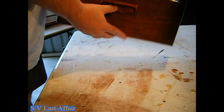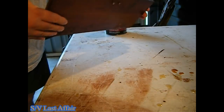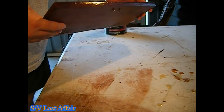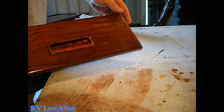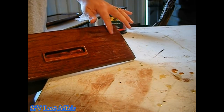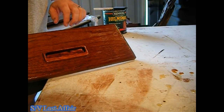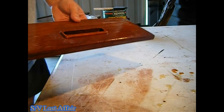Here is one of the faces of an access panel in the rear stateroom — mainly covering storage under the curve of the hull and air conditioning ducts. You can see a blemish here — a high spot that was on the varnish. When I sanded this down, you get that discoloration. As long as you do a light sand between coats, that will not show up after it's done.